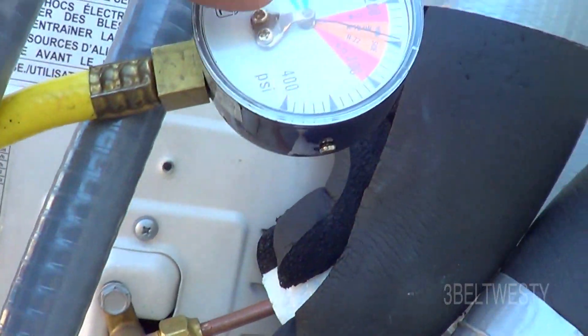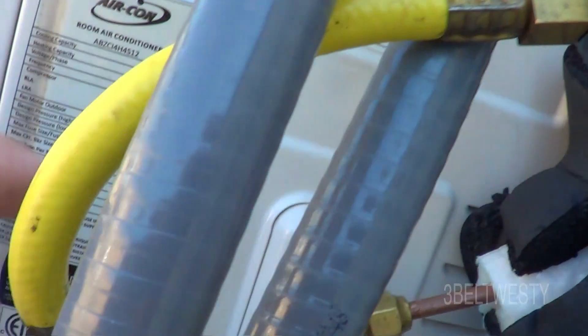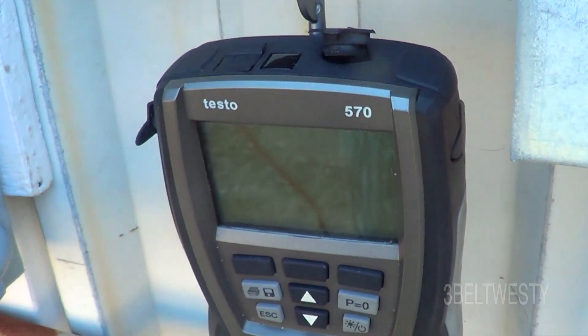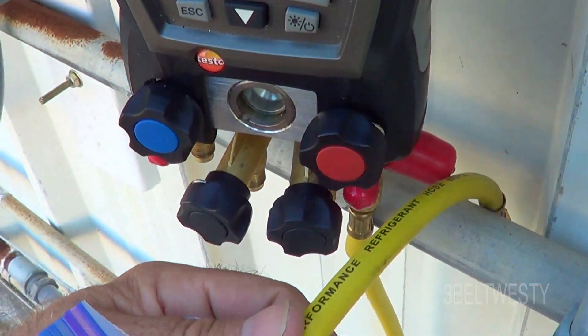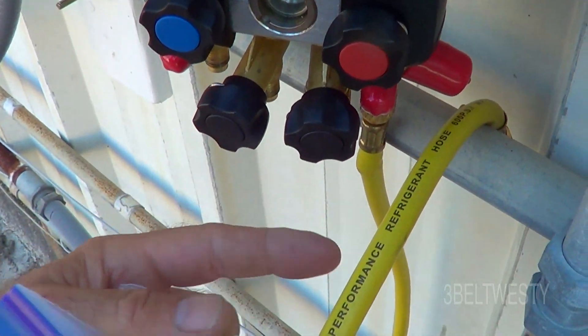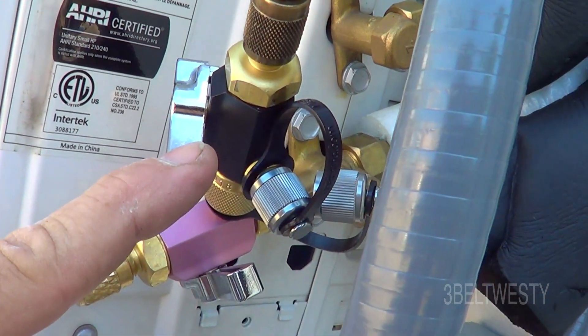You don't want a rubber tube — you want this really connected up to here, but I don't have one like that rigged up. Or you can use a set of gauges; here's a set of Testos. But you don't want to leave the gauge hooked up all the time because you'll leak through the rubber hoses, so that's the reason for the second shutoff here.